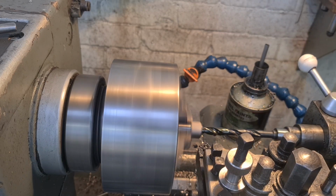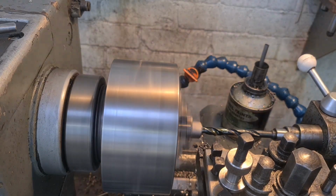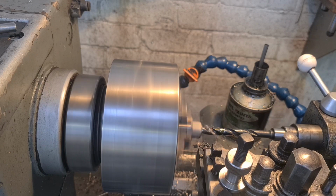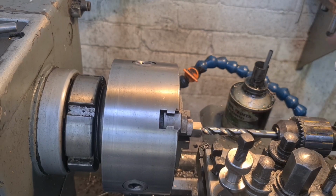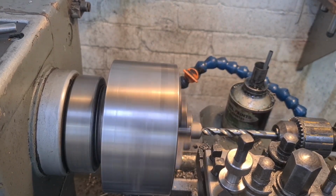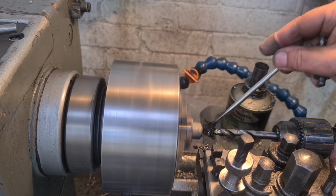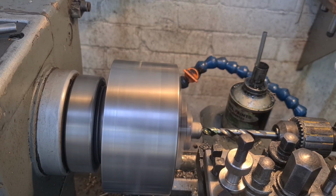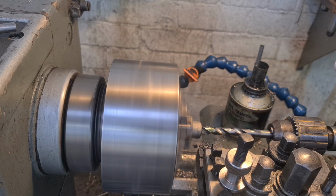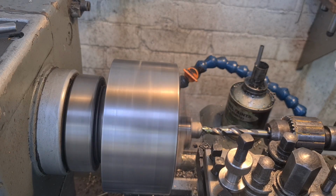It should be 10.2, but first of all, I don't have one. And secondly, I don't want to give the stainless a chance to mess up on me, so a little extra clearance won't hurt. So we changed that to the 10.5. Might be a bit of a squealer. Let's see. No, that's alright. Not too shabby.